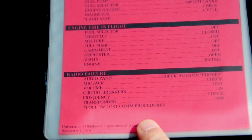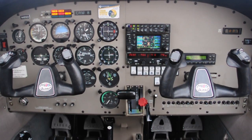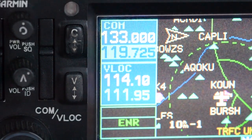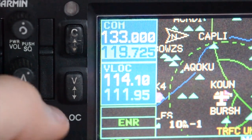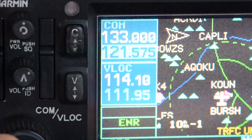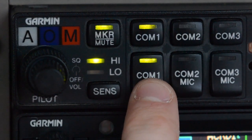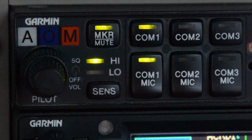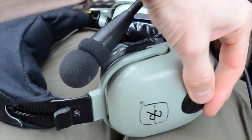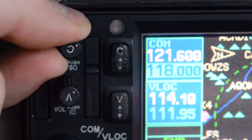One of the first things on this checklist is to check your headphone jacks — you never know, during the flight they might have rattled loose. Next, check your circuit breaker panel and make sure none of the radio circuit breakers have popped out. Also check your frequency — being off by just one decimal place will prevent it from working. Make sure the frequency you're trying to use is in the active position. Check the audio panel and make sure the comm you're trying to use is the one you have selected. If your checklist doesn't help, also check the volume knob on your headset or on the comm itself — during a turbulent flight you may have accidentally brushed it down.